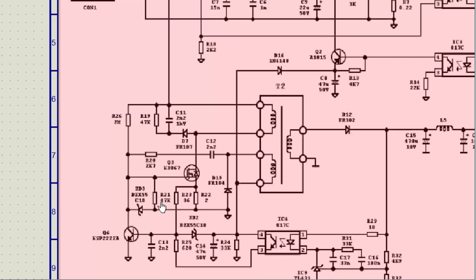The 47K is the high resistance and when the transistor saturates it becomes a short circuit, providing the easiest path, so this resistor is bypassed and ground level turns the FET off. Then the transistor opens because there is no voltage drop, so the voltage drop will again reach a high value and the MOSFET will switch again. The current will flow again and the voltage drop will again reach the base, cutting off the MOSFET. This on-off procedure keeps continuing.